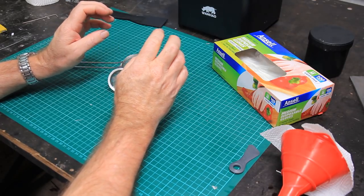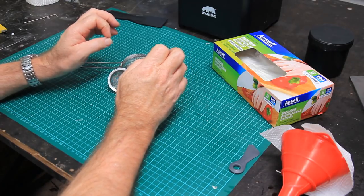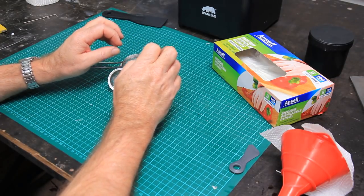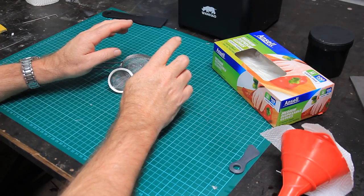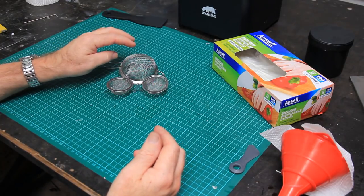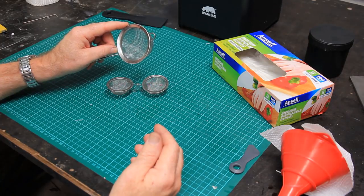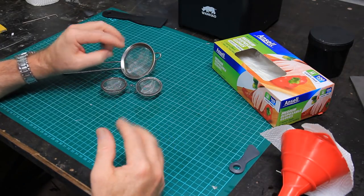What can happen with a print is you can get a misprint where you've got cured resin floating around. Sometimes that can be quite hard, particularly if the print's detached from the base, and maybe some of your base cured components in there have broken off. You can get nasty little sharp pieces of hard resin which will potentially puncture the FEP film in your vat. So this is a good idea. If you have a misprint and you can see stuff floating around in the resin, then definitely strain it, at least with a strainer of this mesh size, which is probably about sub millimeter, I would say, and this is way finer than that. So these are all the tools and bits and pieces.